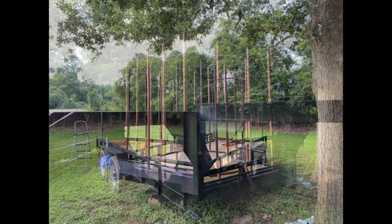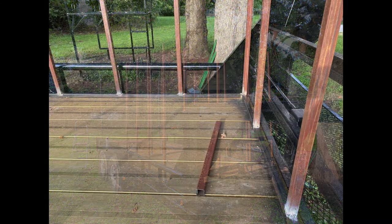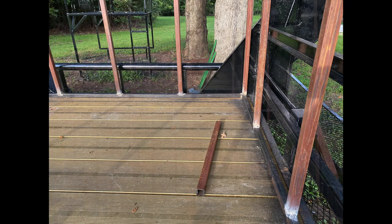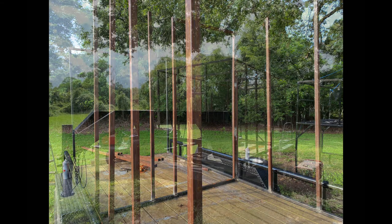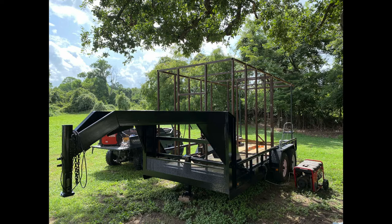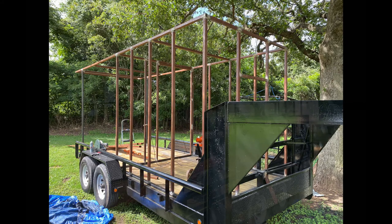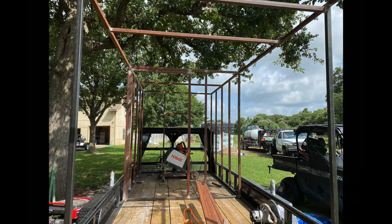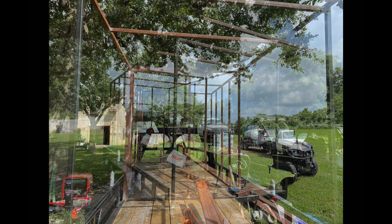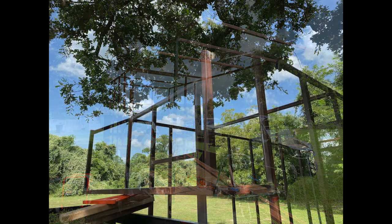When I started framing the enclosure and porch I used inch-and-a-half square tubing — heavy gauge on the floor and lighter gauge going up, trying to keep the weight down. I built everything right there on the trailer; the support beams were welded in place. If I had to do it over again, I would have laid them flat on the concrete, welded the walls together, and stood them up as one piece. I did do that with the roof — I laid it flat, put it all together, then slid it on top and welded it in place.